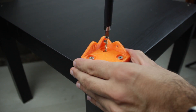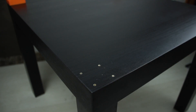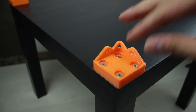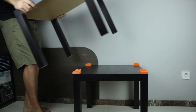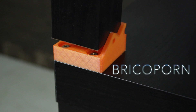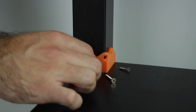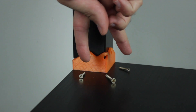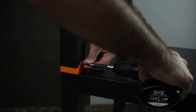After the screw explanation, I'm going to start the assembly. First I'll attach the 3D printed pieces to the tabletop. Once done, I'll put the new table on top of the other — remember to check that the legs are strong enough. Now we'll insert the screws for the legs, pressing it down while inserting. Remember: the two 20mm screws go in the faces of the leg and the 30mm one goes in the edge. We'll repeat the process with the other three legs.